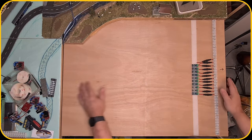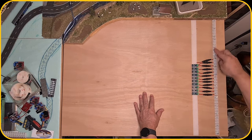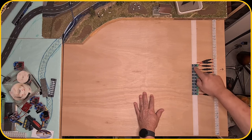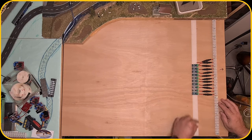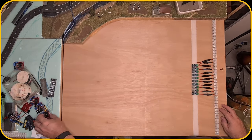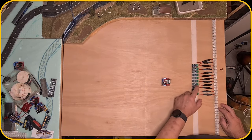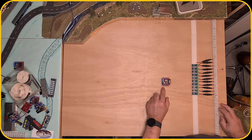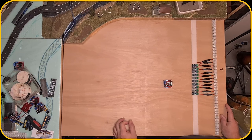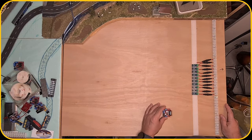So this is the board where the whole power section will be built from, and I already added the screw terminal strips, the fuses, and some current sensors over here. There will be a whole bunch over here and a whole bunch over there, but I still did not get them in. And then of course we have our motor drivers, which all need to be connected to. And looking at the number of power sections, this will be a lot. So I have a lot of those and I need to position them somewhere.